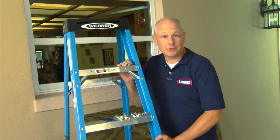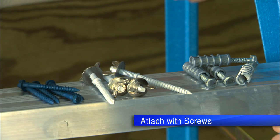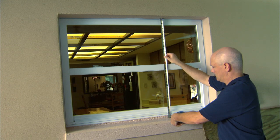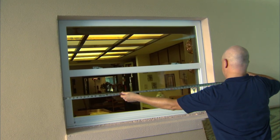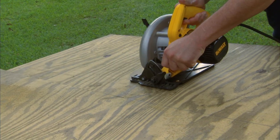That's one way to board up your windows, but you could also use concrete screws, anchor screws with wing nuts, or lag screws with anchors. These techniques also work great with doors and vents. For each window, measure the width and height of the casing and add 10 inches to each dimension. If you have a sill, only add five to the height. Mark the plywood and cut it with a saw.